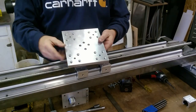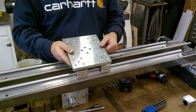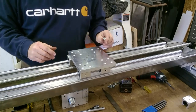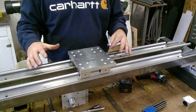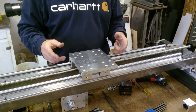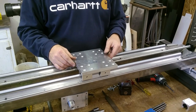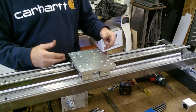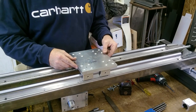This plate was all machined on the mill with a digital readout — somewhere in my folder is the document with all the spacing on it. When I dry-fitted it last night, most of the stuff wasn't bolted down, and it just didn't roll right. I've done everything I can to make all the pieces perfect, except one: the tubing down here. This morning I cleaned everything up, made sure it all fit, and started screwing things down. The spacing here is very critical — I have almost no adjustability, it had to be spot on. Lots of holes, lots of places for things to go wrong, and sure enough it was wrong.